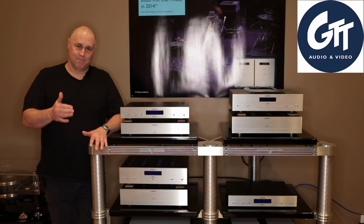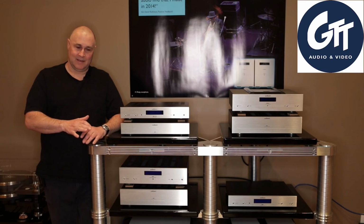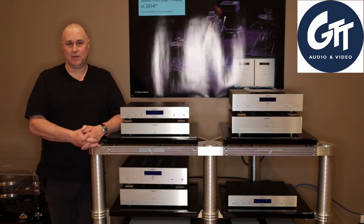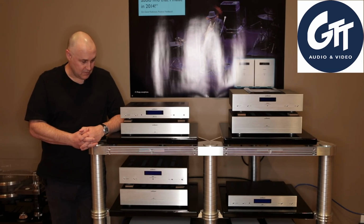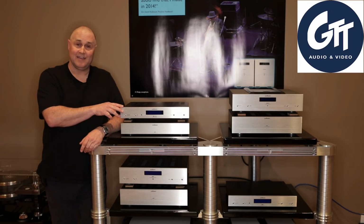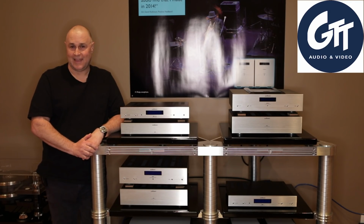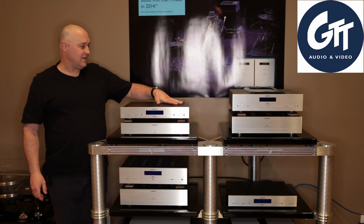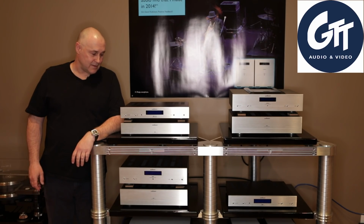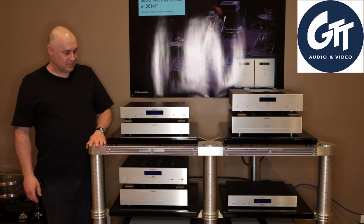And most manufacturers that are getting to, like this, 24 ohms, when you're getting under 30 ohms, under 50 ohms, most of them are correcting for that, saying, okay, well, we need to put a little piece of circuit in there to make sure that we have a very strong backbone, a low output impedance. Well, AudioNet's claim to fame is that it's real. It's 24 ohms real, not corrected for, but real. That means the entire circuit, that's the impedance of the circuit. That's a natural, uncorrected output impedance. So I just think it's incredible.